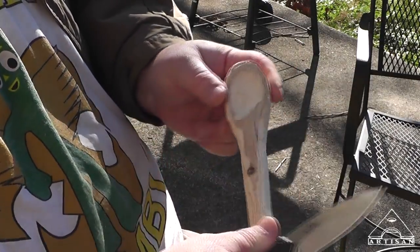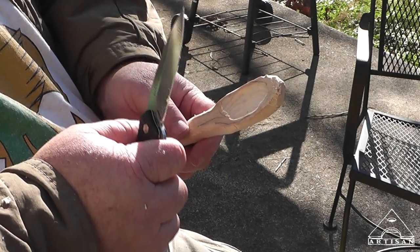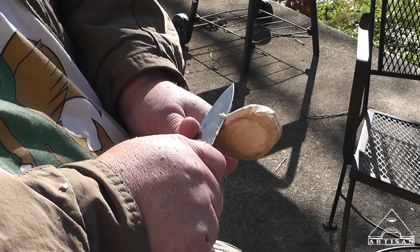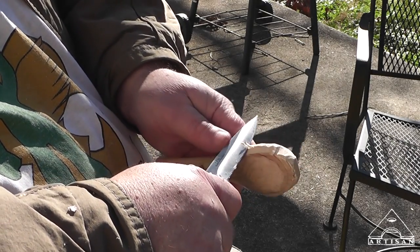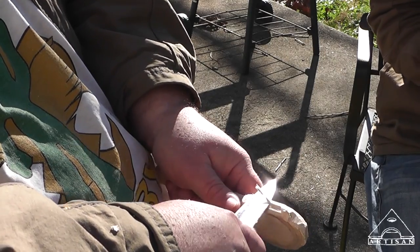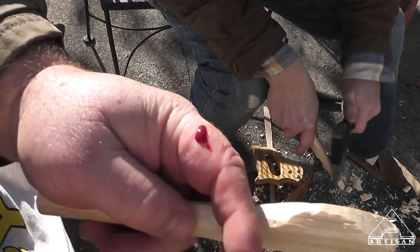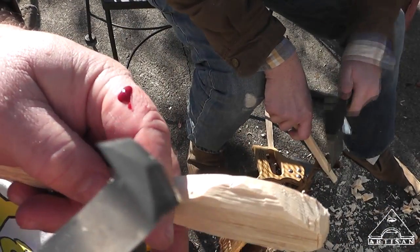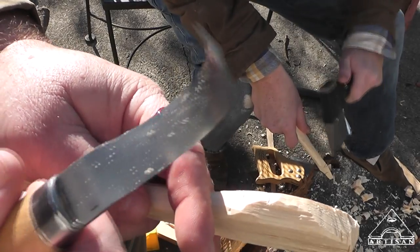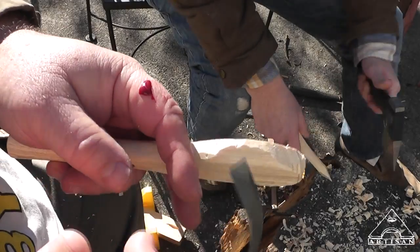You want to keep your cuts going away from the bowl — if I start cutting this way, it's going to hit a grain and you risk taking off part of it. I did the same thing on the side — I'm just going to round that part over. See how I'm starting to control it? I got more control because I'm pushing. I was just telling Barrett not to cut towards himself, and my carving knife slipped a little bit and I got myself. It's no big deal, but it could have been worse if I hadn't had it braced against the work with my thumb braced. This thing is so sharp it will cut your finger off even being careful.